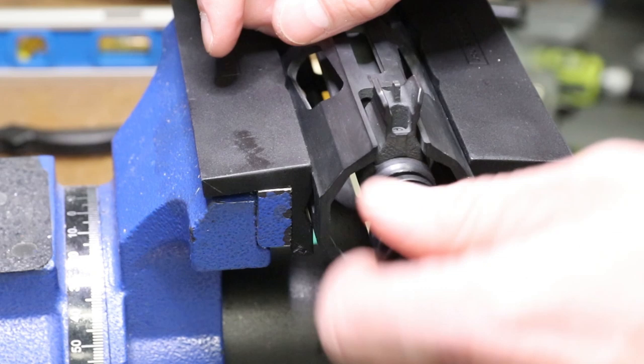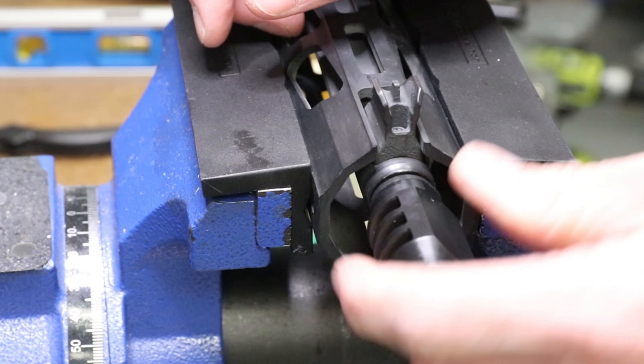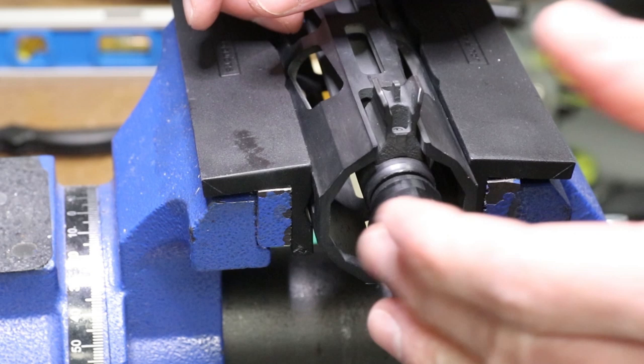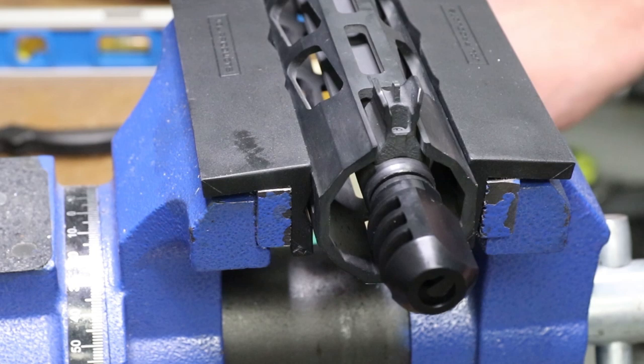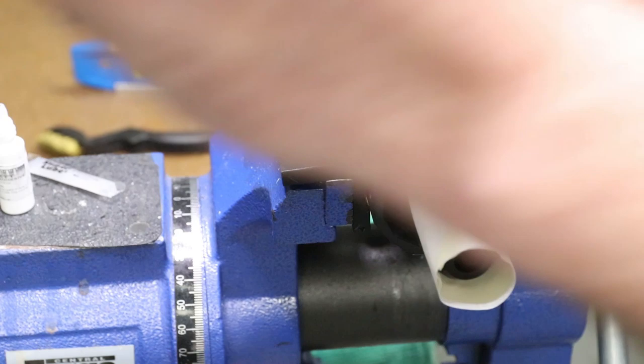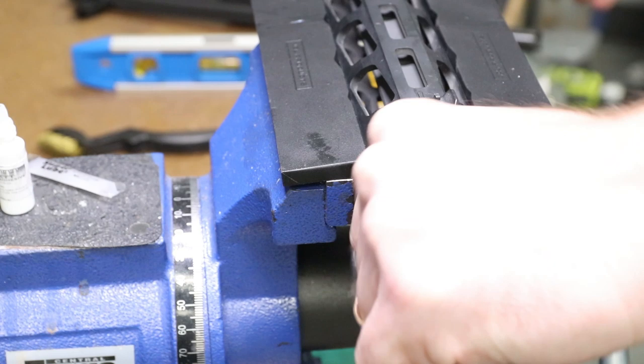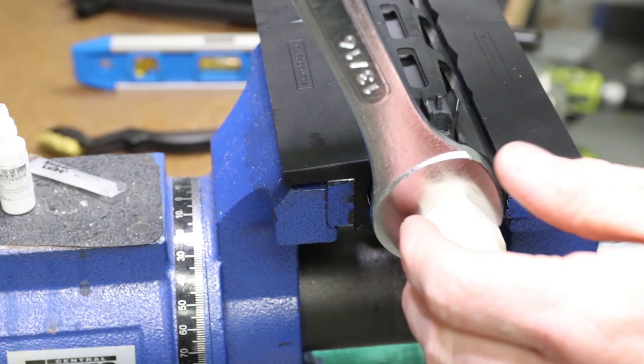You can see where we're at right now - we're nearly timed. If we were to take just a quarter turn, that's not enough - we're going to do a full turn and make sure we get timed that way. We already know 540 degrees of rotation, so we'll be just fine. We can go ahead and run the full rotation and get it timed. Do our four wraps of masking tape: one, two, three, four. I know it's kind of a pain to have to use tape, but if you want a scratched up brake, it doesn't matter. You can just run it as is - you don't need to tape it up. But I recommend the tape. I think it's worth it.